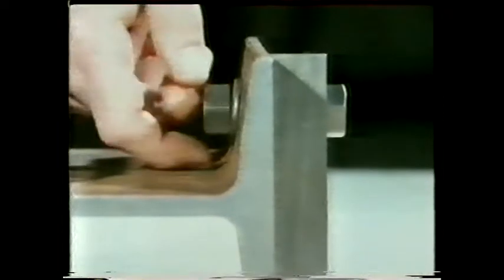The lower edge of this nut bears down extra heavily on the surface of the component. By using a taper washer, you distribute the load evenly over the surface of the assembly.